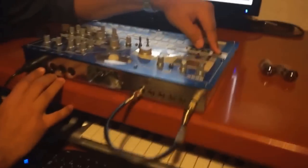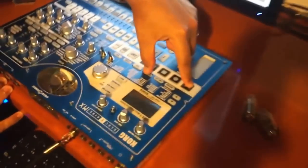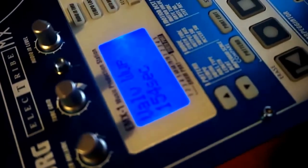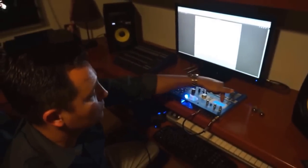Now I need to press Erase and Step Edit while I turn it on. So: Erase right here, and Step Edit right here. I turn it on and look at the screen — it's going to say test version. And now it's going to warm up the tubes for 154 seconds. Once it warms up, it's going to try to read how out of balance the two tubes are, and it's going to give you some readings on screen.